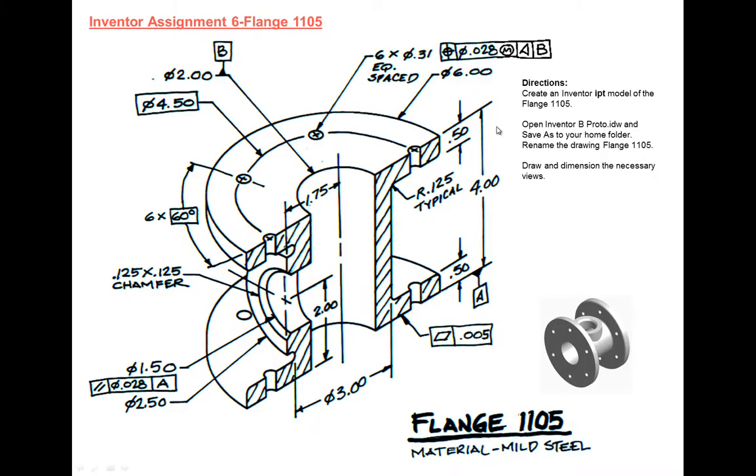So what is different on this? I'm going to give you an input sheet, and what we're going to do is change these numbers to the new butterfly valve body, and then that's what you're going to model it to. When you look at your butterfly valve input, these thicknesses change. The hole pattern - we have ears instead of big flanges. We do have this one that's 1.75 off the center, and the one on the body is 1.594. That's just a simple dimensional change.